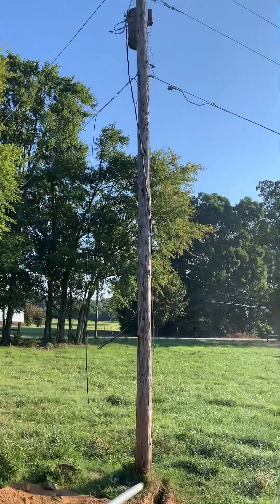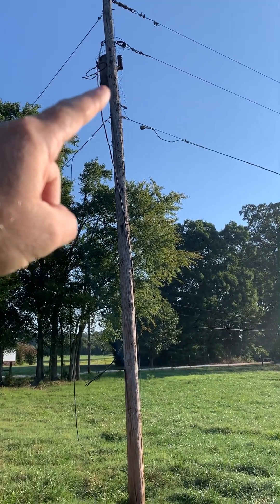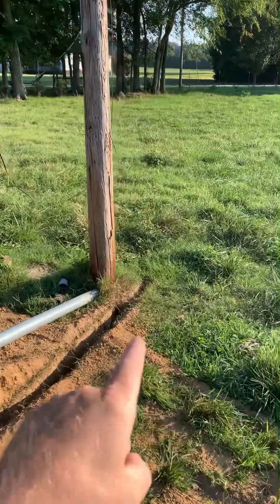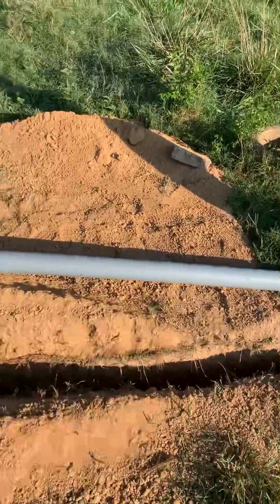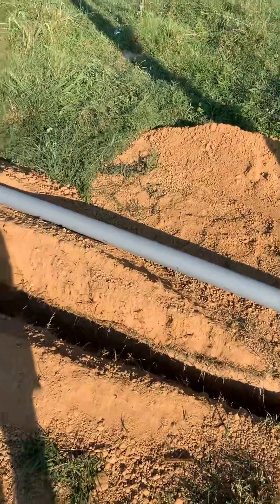We're going to try to push off one end and let it drop all the way into the ditch for 300 feet. With an underground primary, the overhead electrical service comes to a pole with the transformer. We will run Schedule 80 conduit all the way down the pole into the ground, put a rigid metal 90 sweep on there, which ties into Schedule 40 conduit, with a string all the way through so the electric company can pull their wire through.